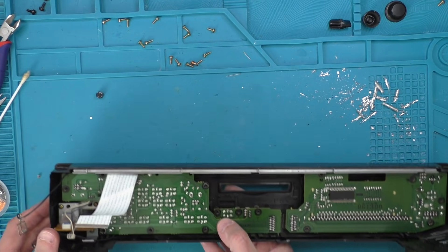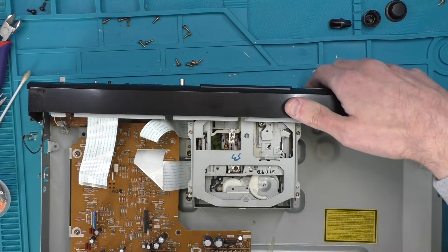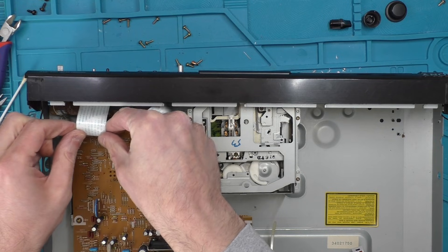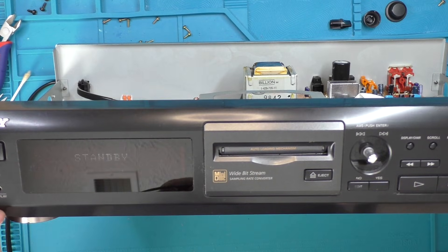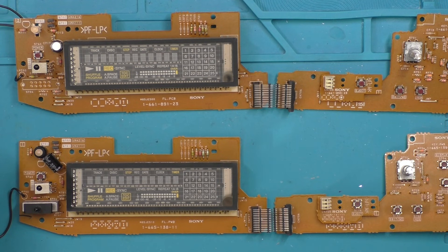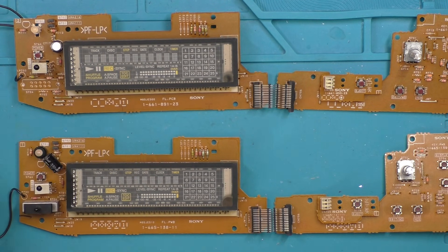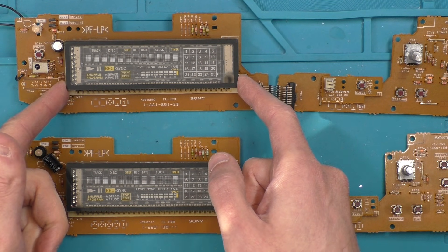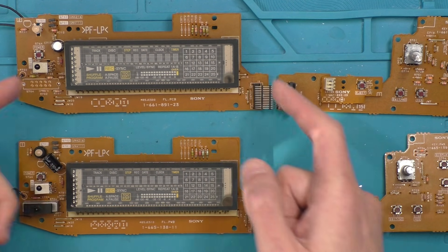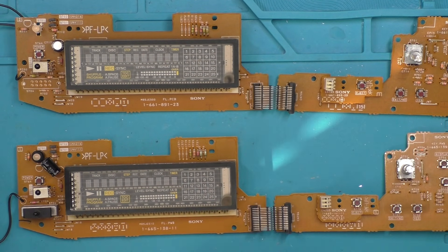Surprisingly it seems to go in the case. I'm not going to put all the screws back in yet just in case it doesn't work. I'll reconnect this cable and plug it in to see if there's any improvement. No, that looks just the same as it did before. I did a quick comparison of both display boards and as you'd expect they're very similar — the displays appear to be identical, all the markings are the same, and all the resistors are measuring similar values. So I don't think there's any value in swapping out components. I do think it's worth running some voltage through the heater wires of this bad display to see if it responds at all.